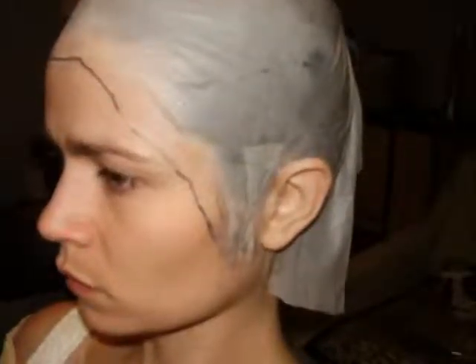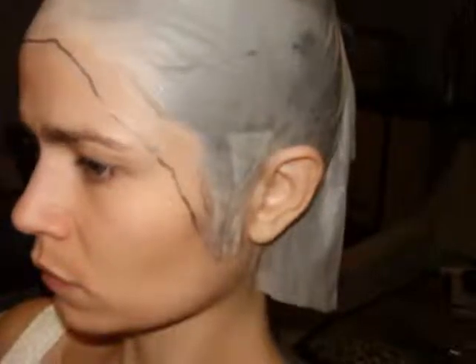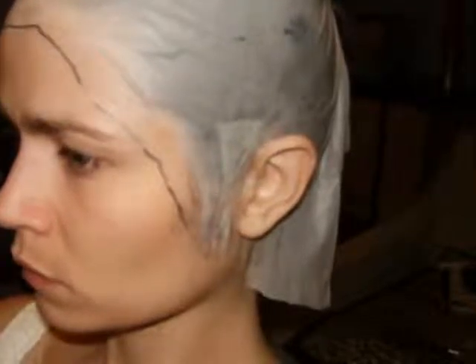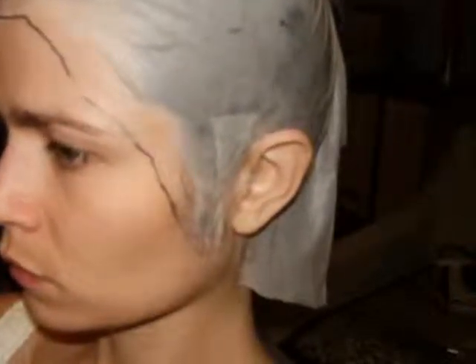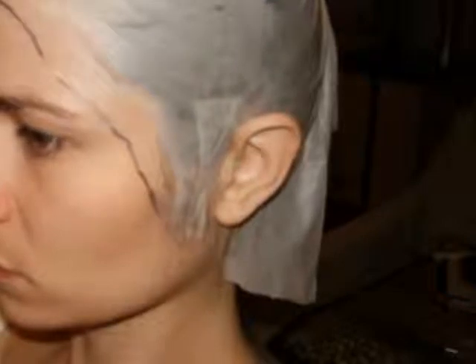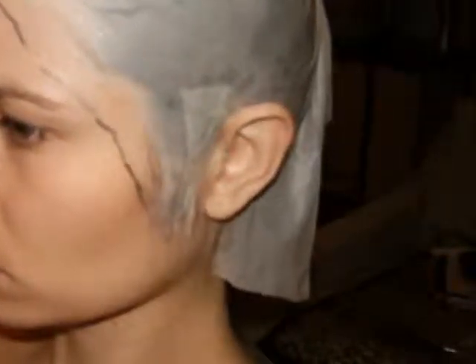It's important to have a skull cap to protect the hair, otherwise the Body Double mechanically locks to the hair. There is a Smooth-On introduction to life casting video that shows you how to use this product, and I recommend watching it about ten times before you even think about starting. This is a non-latex skull cap that has been adhered to the head using spirit gum. You can see it's kind of a patchwork quilt — I had no idea what I was doing.